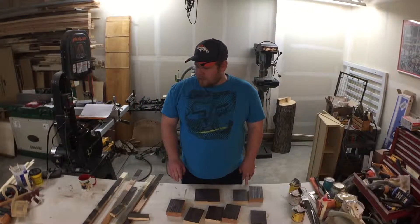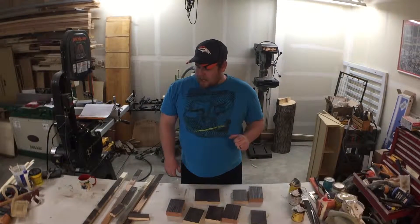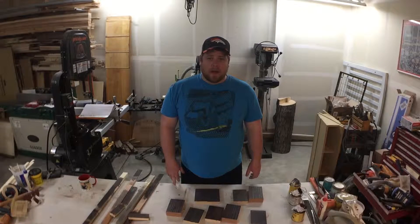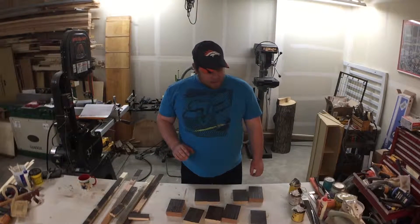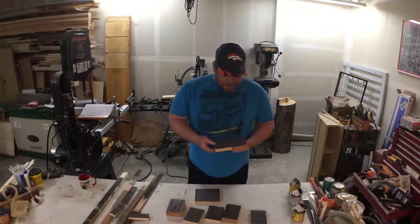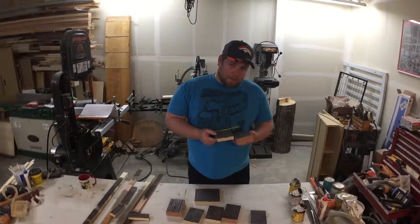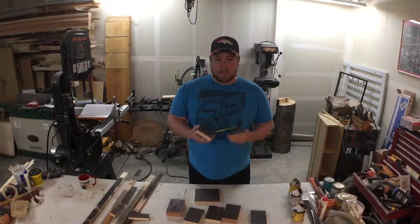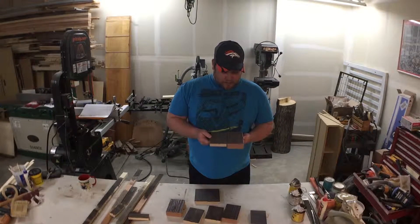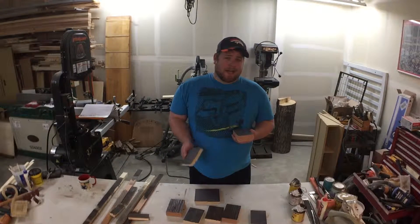Today is a new day. I was up pretty late last night figuring out what I wanted to do for a stain, and after 40 or 50 different combinations, I've come to a decision. It might be surprising, but it's the same stain on both species of wood — just a classic gray by Minwax. I sanded, stained, let it dry, and applied two coats on the pine to bring it closer to the gray on the Douglas fir.